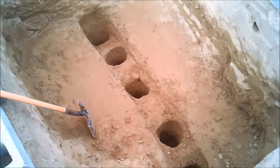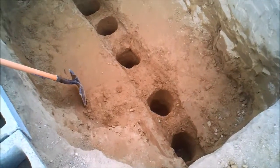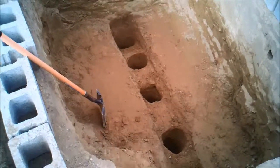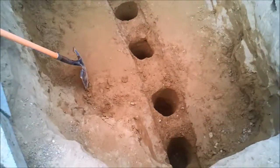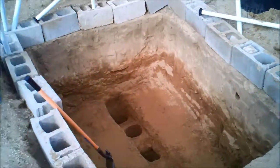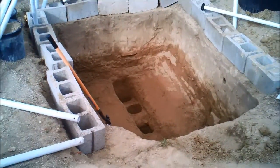Fortunately there are ways to get around that. Around here the clay is pretty bad, so I dug a trench in the middle with the sides sloping down into it, and I got holes about 2 to 3 feet deep — 5 of them. That's a good 10 gallons or more of drainage, and I'm going to fill those in with gravel and maybe some bigger rocks.